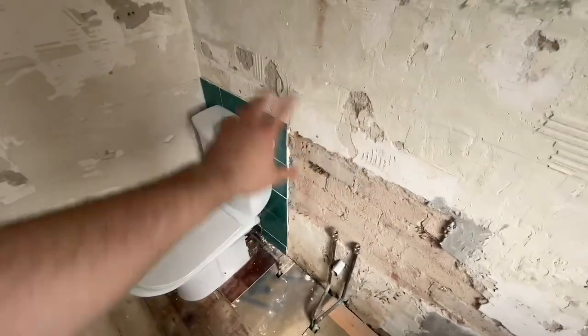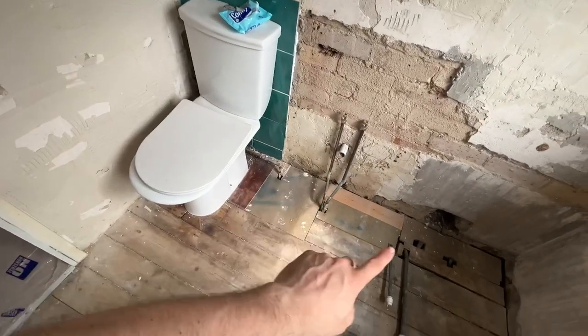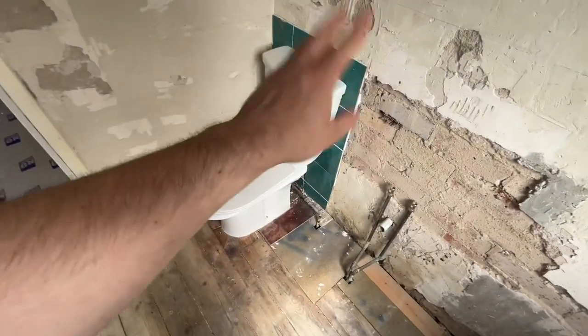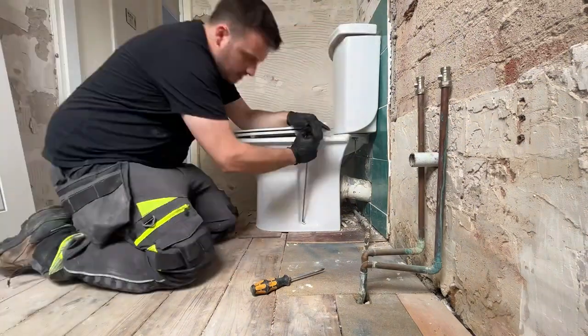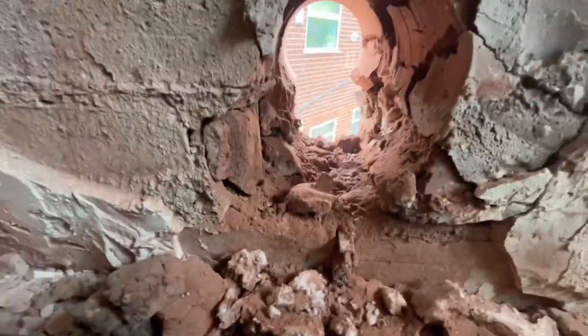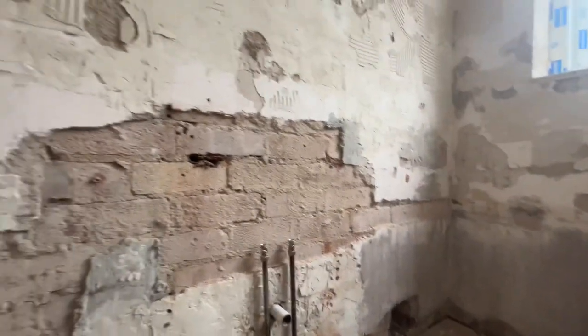Right, back again - it's day 8. We didn't actually film anything else yesterday, I completely forgot - one of them things. Half day today, I had other duties this morning, so we've got half a day, it's now one o'clock. We've got the toilet to take out, we'll core a new hole through and sort all our pipes outside, get a new inch-and-a-quarter pipe through here, new inch-and-a-half pipe through there. That's my job for today. First job: toilet out, tiles off, rest up that floor.